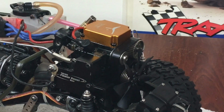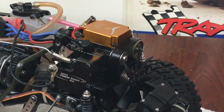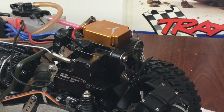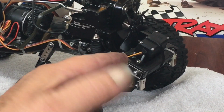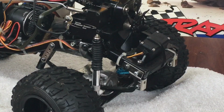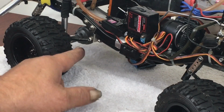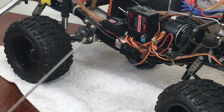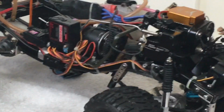I'm going to try to take an HDP 407 shaft and convert it to fit inside there, because I guess a leaf spring truck or car has what they call axle wrap. So when you're tearing into it, the axle wants to tilt forward because the wheels are pulling it, so it pulls it down. And then the back axle wraps up in the air at a pretty steep angle. Now in the back, you can put ladder bars on there or whatever, but these actually did have lateral bars on there, but everybody takes them off for crawling.